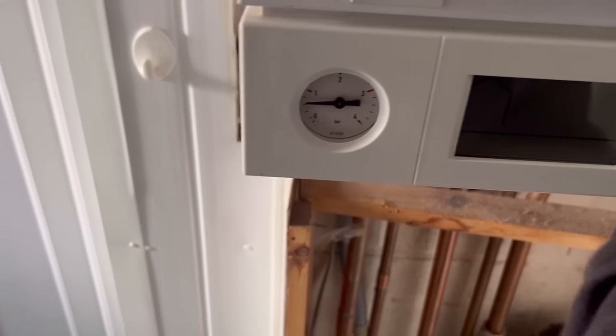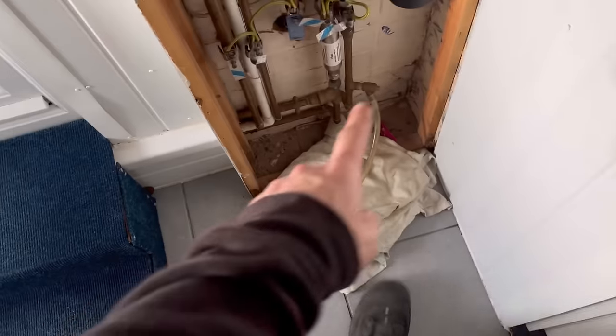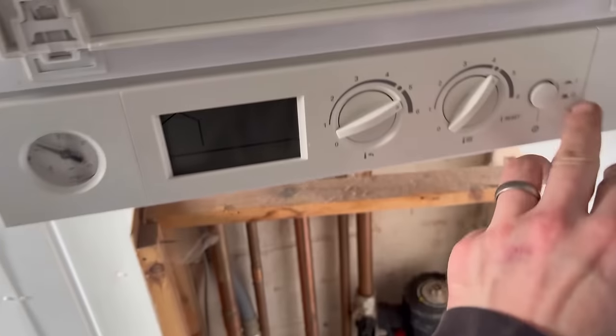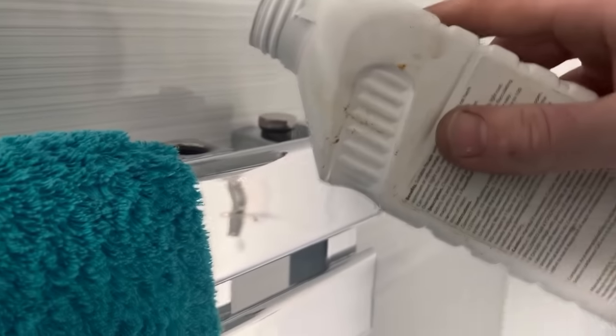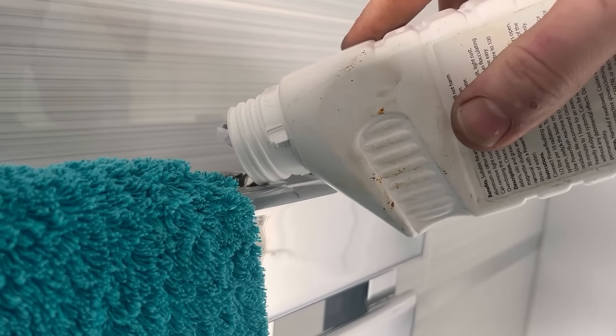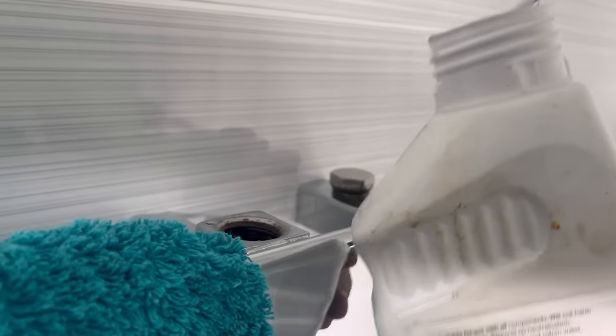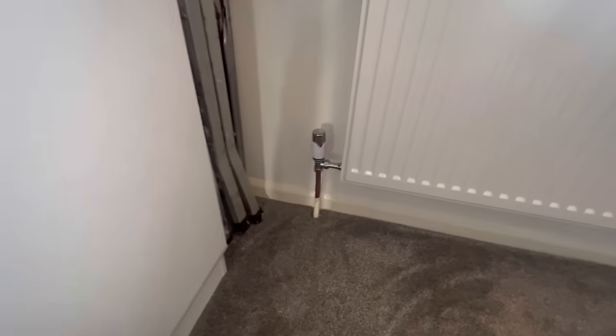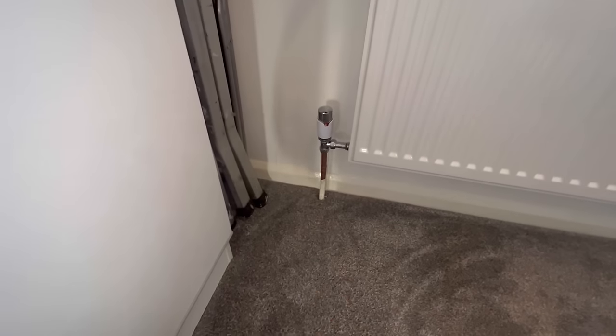Just finished bleeding the rads upstairs. Going to put the pressure up to just over one — there's a nice drain off close by, so I can get that over one. Going to run the heating up to temperature to make sure there's no leaks, then start packing away, get everything on the van, and have a cup of coffee. Getting the inhibitor in between this last job — a little tip: put the inhibitor bottle with the arch facing that way and it won't leak. If you do it the other way it will leak. Get that back on, turn the rad gate valve — there we go, all getting warm now. New radiator is perfect — a bit of an extension behind that one, but they're happy with it.